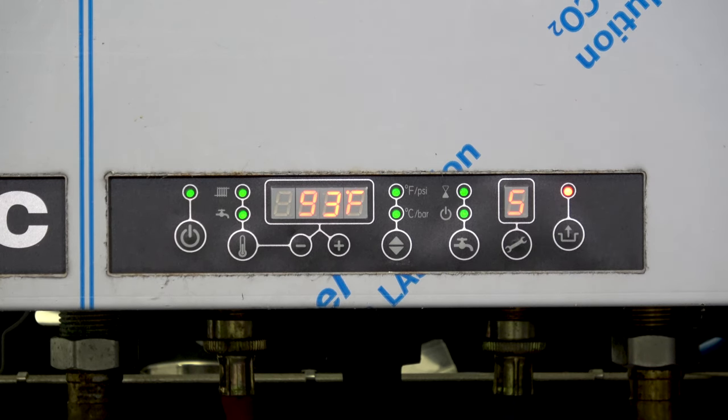The next option is capital O-dot — the space heating time delay. This is how long we wait after a call for space heating before we allow the boiler to do its thing. It should come factory set at zero, but you want to check and make sure it says zero. I've seen one situation where it was set at 13, so it was waiting 13 minutes before the boiler started, and we were scratching our heads as to why the boiler didn't work and then suddenly, magically, it would turn on. So as you're going through O-dot, make sure it's at zero.